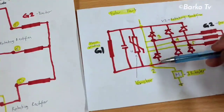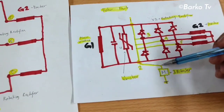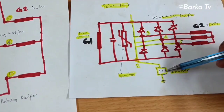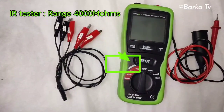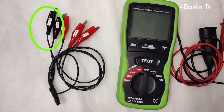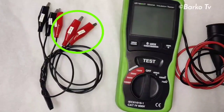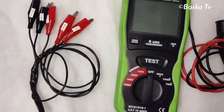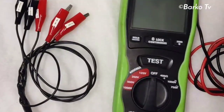These are the five points — one, two, three, four, five — that we need to short or jumper before we do IR testing. I have here the five alligator clips: two black and three red, labeled one through five. The two black clips are for the main rotor winding and the three red alligator clips are for the exciter winding. We also have an insulation tester — these alligator clips are DIY.